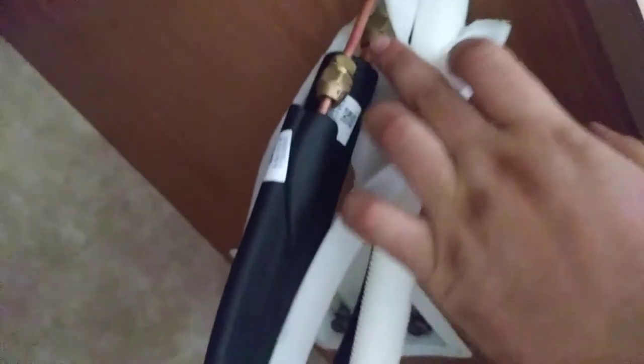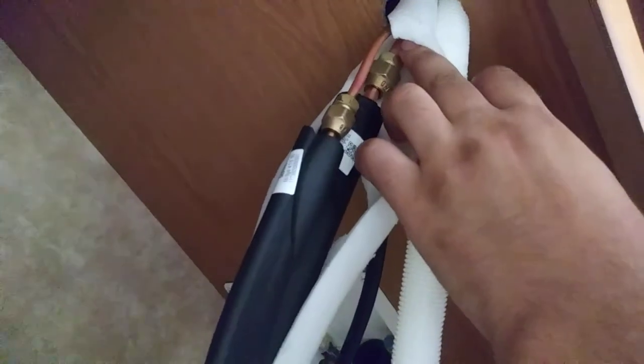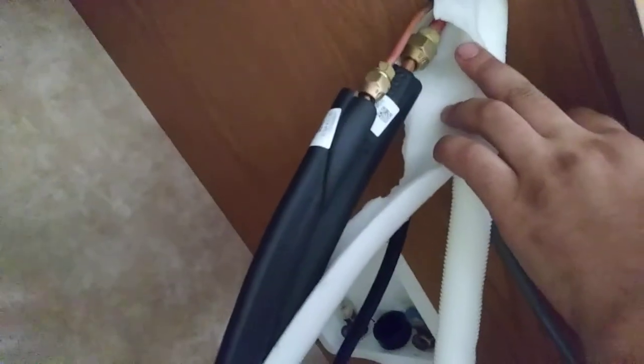I usually like to cut these out of here, but we're in really tight space. I didn't really have enough room to braze — I mean, I could have, but it just didn't seem worth it. It's a trailer anyway, it's probably temporary, so this will actually make it easier to disconnect in the future. We did use the torque wrench on all the flare fittings, of course.